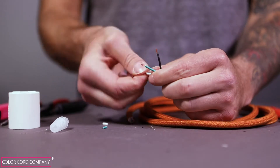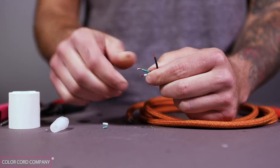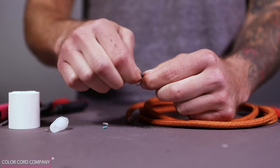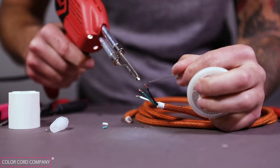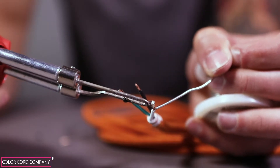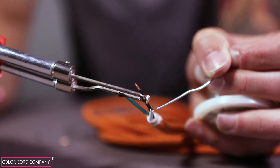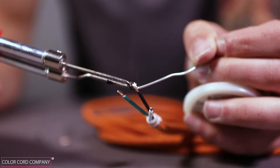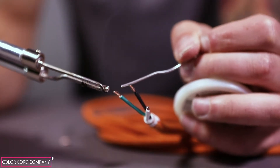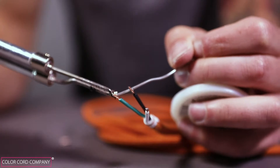Using your fingers, twist the stranded wires together. The next step is to solder the copper stranded wire. While this step is optional, we highly recommend soldering the ends for a stronger and easier to manage contact point when connecting them to the terminals. If you don't have any soldering experience, you can check out the video 'Tinning Explained' on the video page of our website.